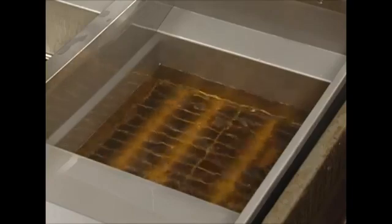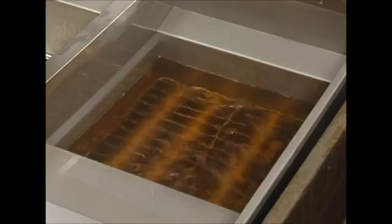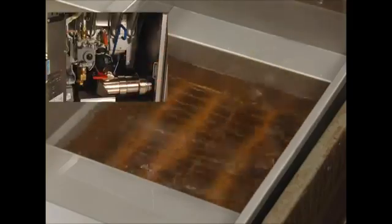Once all the oil is pumped back into the tank, you'll start to see bubbles emerging from the oil. Allow the pump to run for an additional 10 to 15 seconds to return any leftover oil from the filter pan or the filter return lines. After 10 to 15 seconds of bubbles, close the valve and stop the pump by pushing the red return valve handle in. Once the oil is still, you'll notice that the oil level is less than when you started. Make sure that it is above the minimum line and below the maximum line.